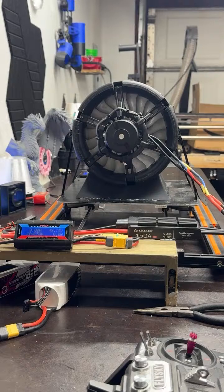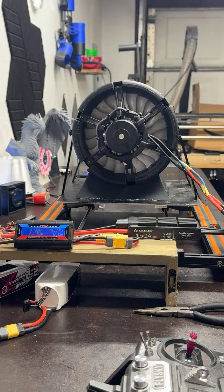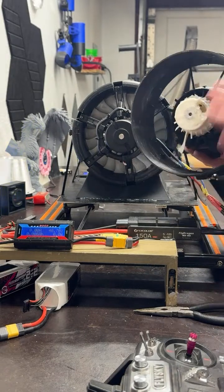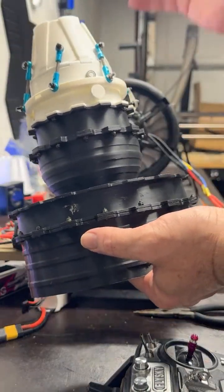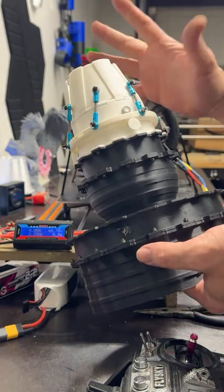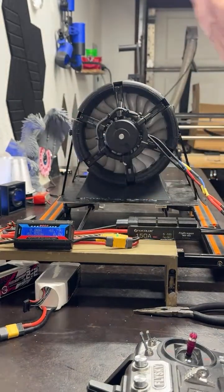All right. Let's do this again. Does anybody have any questions about what's going on here, what I built this engine for? First off, let me explain what's going on here. This is a 170 millimeter 22 blade high pass fan. Like its predecessor, which had an unfortunate accident, this one was pushing a secondary rear low pressure turbine and an aperture for experimental purposes. Obviously, the idea was to put an afterburner on it, and so on and so forth.